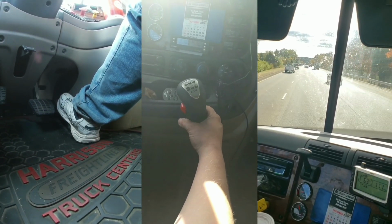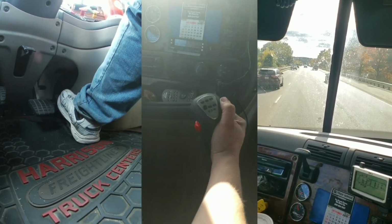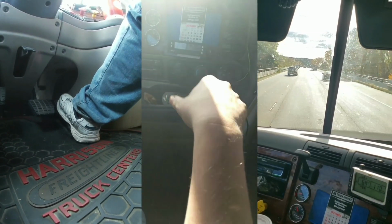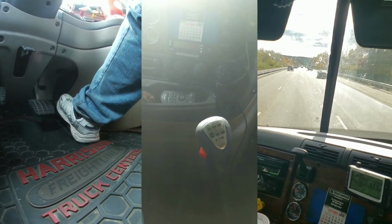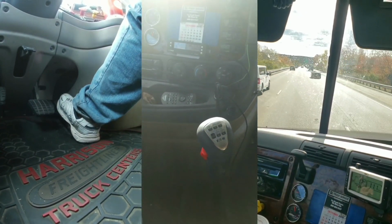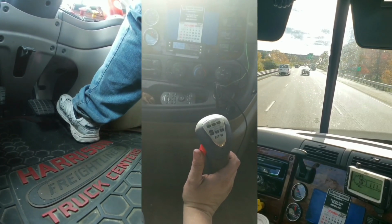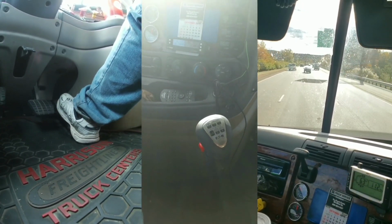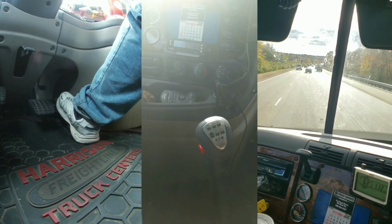Moving it down into the next gear because we're going from the high side of 7 to the low side of 8. So just that little bit of thing there. And it's kind of a feel. Once you actually start to do it, you'll get it. You will definitely get it. But you got a whole lot of nothing going on. Go back in the big hole and cruise at about 1400 RPM. Alright.